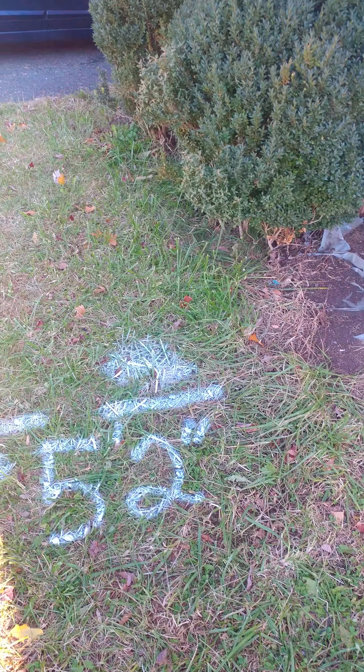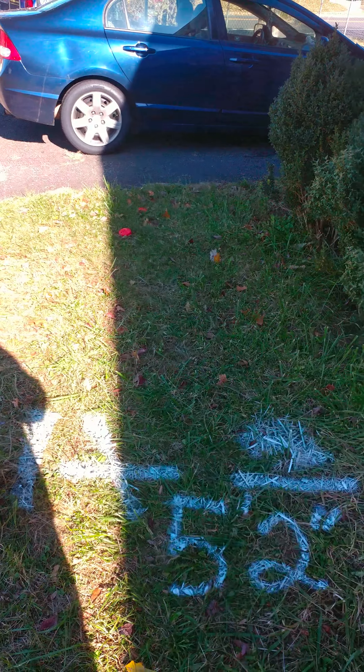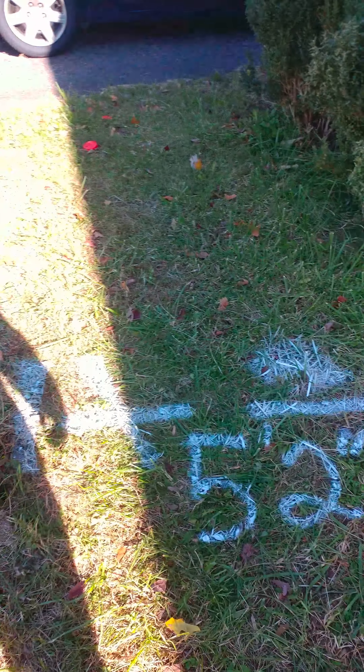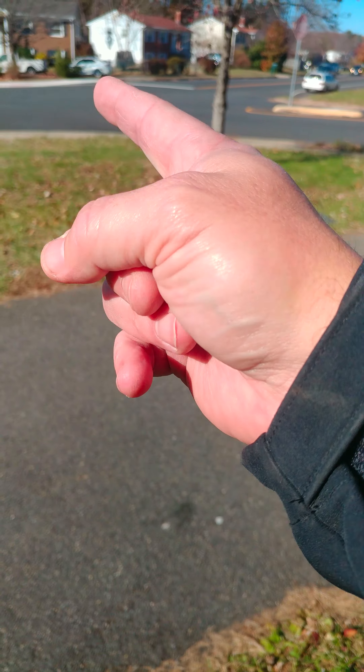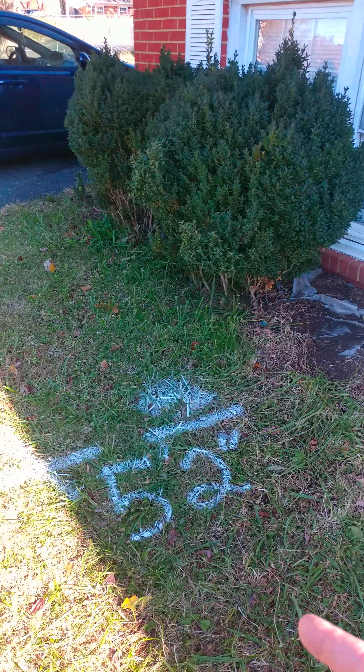It's really high up. So we dig down here, we take the light posts out, we put the light posts to the side, we pile all the dirt on top of plastic and plywood, dig down five and a half feet deep, pull out the old pipe, and video the rest while we have it open. The pipe is broken and 100% full of roots right there.